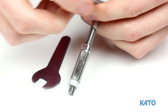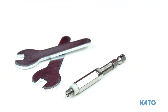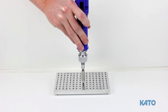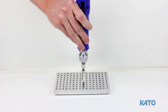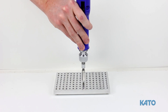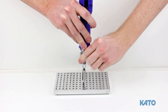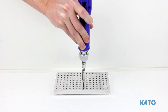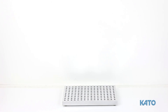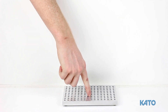Now that the depth is set, we are ready to install some inserts. With the installation mandrel in the electric driver, hold the tool perpendicular to the hole so that it is straight and avoid holding it on an angle — this could cause the installation to fail and may damage the installation mandrel. Always use the minimum amount of torque that will install the insert. Begin with a very low torque setting; this will cause the driver to automatically reverse before the insert fully installs. Press the trigger to activate the electric driver. Note the insert started to enter the hole, but the driver reversed automatically because the torque wasn't enough. Turn the torque nut 180 degrees or half a turn and try again. Repeat this process until the insert fully installs. Check the installation depth and readjust if necessary. For holes with a countersink, you'll want to be 3/4 to 1-1/2 threads below the surface.